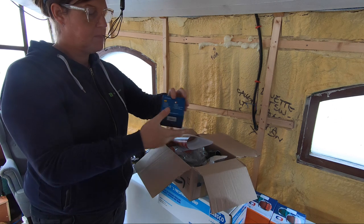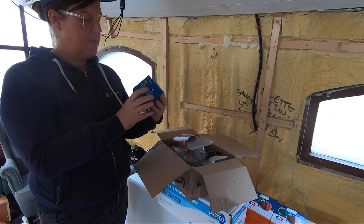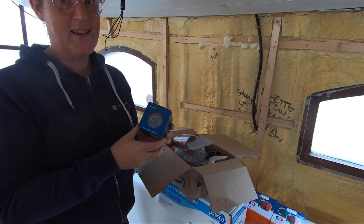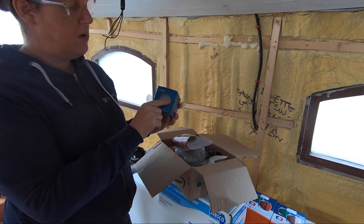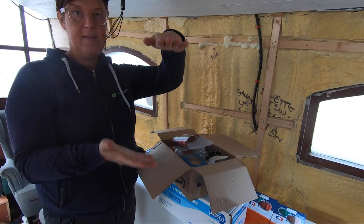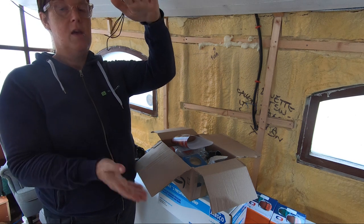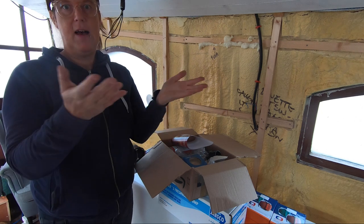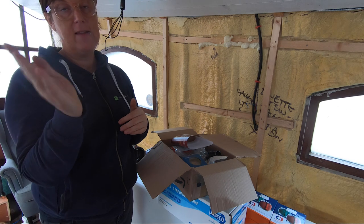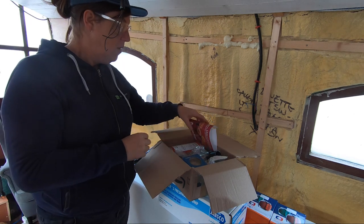The final thing I've got is a gauge for the waste tank. This is a gauge like a fuel gauge, but it's a waste tank contents gauge, and it will tell me when the tank is getting full. The only wrinkle is that the sender unit that goes in the tank isn't actually long enough to span the entire tank, so it's mounted in the top section. This means there will be some period when the tank is being filled but the gauge won't move — but that's okay, because it's just the lower end. It'll warn me when it's getting full, and it'll just take a little while for the needle to start to move.